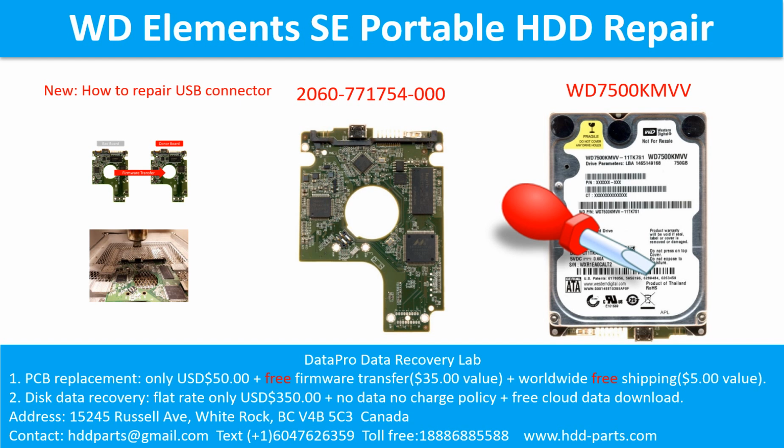Hello there. In this video we are going to talk about the WD Elements SE portable hard drive, the printed circuit board repair, and the disk data recovery. For this case, the printed circuit board number is 206077175400. The hard drive model number is WD7500KMVV.